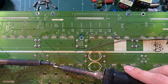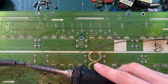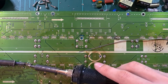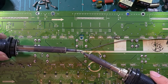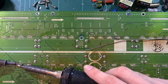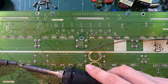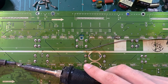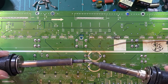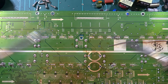Like, you don't need to desolder each pin individually. Desoldering irons, a specific one with a pump in it and everything, are pretty expensive and not very good for plated through holes on boards like this. I've had many a frustrating day trying to get parts off these kind of boards, and the hole never quite clears. Give the irons time to heat up between runs of maybe two components or three, depending on your thermal mass.